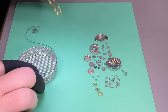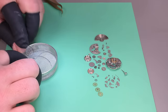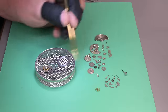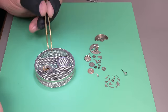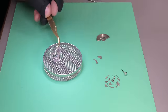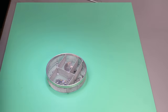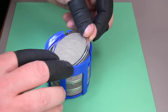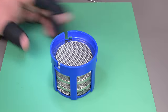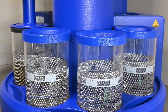With more friction we'll see a bit less amplitude. My jacot tools — the one of appropriate size to address these pivots has a damaged lantern, so we're going to go with it as-is. It'll still run fine. I'll address those pivot repairs later and show you them in a future video. You can see my worn-out finger cots from pegging the jewels. All parts are in the tray, repairs and pre-cleaning are done, and we can move to the cleaning machine.